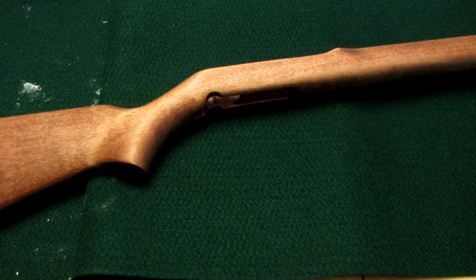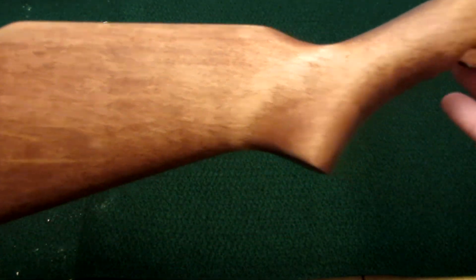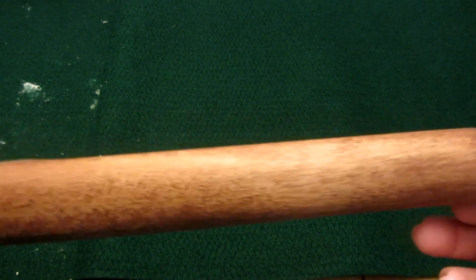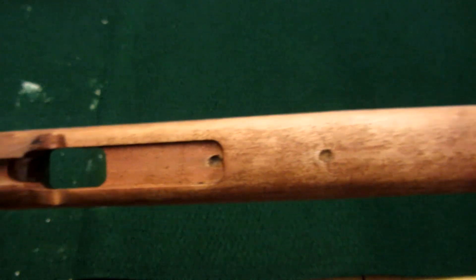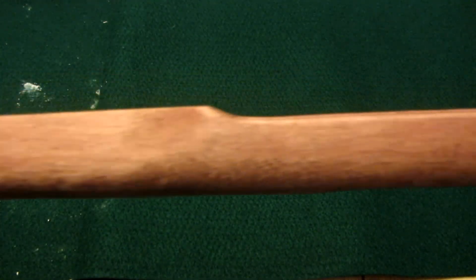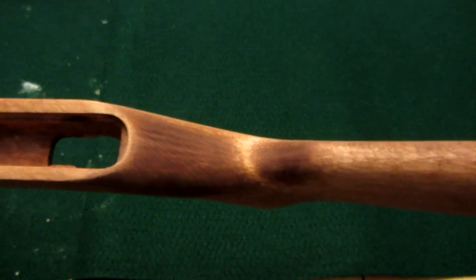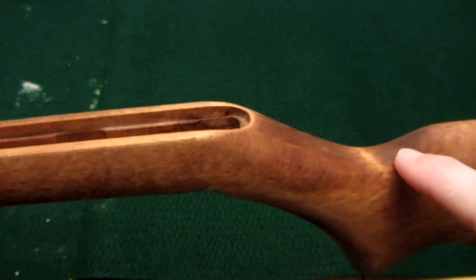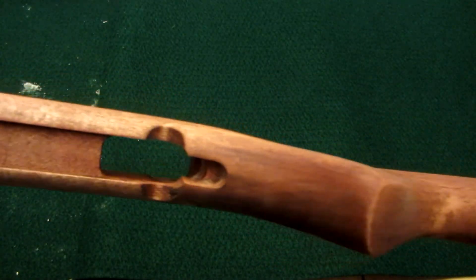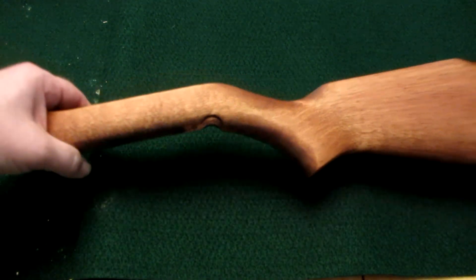Here you go — now we have stained it with a Minwax product. I wanted a lighter finish than the original stock had. You can see how this looks; you'll notice some of those scratches are still there — it is some of the character of the gun. You'll also notice as we go over the stock some much darker areas. I applied the stain evenly in one coat across the entire stock and let it sit the same amount of time — nothing was gone over twice. So these dark areas I'm guessing are just a natural part of the wood where it readily accepted the stain more deeply. Prior to putting any lacquer finish on here I'm a little concerned about how it's going to look, but there's not much I can do short of stripping it down again, which I really don't want to do. So at this point I think it's just time to go ahead and apply the lacquer finish and see how the final product looks.